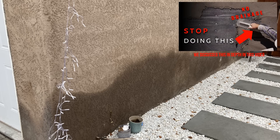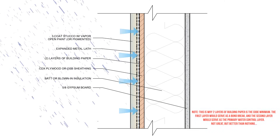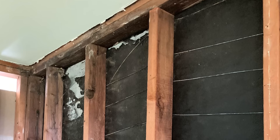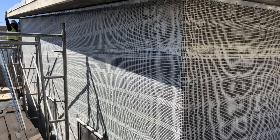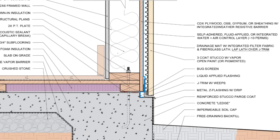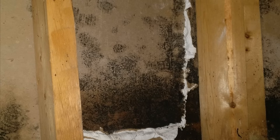If the stucco is bonded to our weather-resistive barrier, we get a complete loss of water repellency due to capillary continuity, and water makes its way inside. This is exacerbated when the sun hits the surface of that stucco, because then it's rapidly driven to the interior both in the form of vapor and liquid water. Providing a drainage gap with some sort of drainage mesh or drainage membrane like a dimple mat will provide the benefits of a bond break, a capillary break, and drainage to direct water away from the building. Then we finish off with our standard stucco rendering with expanded metal or fiberglass lath. Also, you don't want to install any vapor-impermeable wallpaper like vinyl wallpaper or any impermeable paints like epoxy or oil-based paints on the gypsum board. You need the walls to be able to dry out back to the interior, and those finishes will stop or slow inward drying.